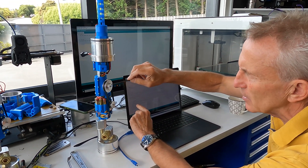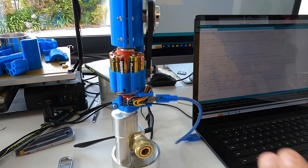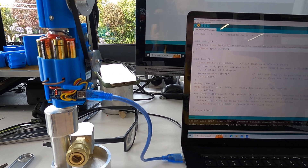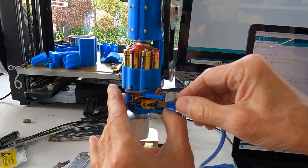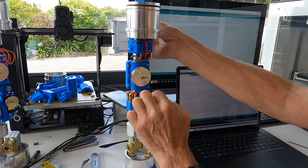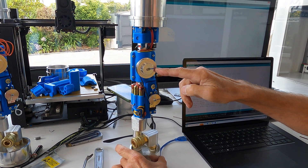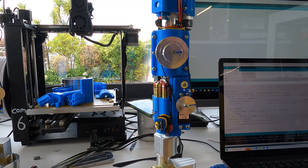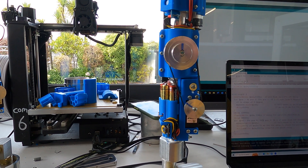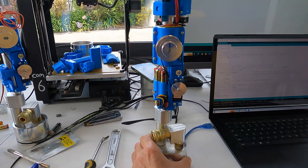What I'm looking for is a 90-degree movement of this — I want that blue line to be vertical, that's the ball valve fully open. We're actually reprogramming one of the nanos right now. Okay, we're uploading that now — that's done, so it's got the new value setting. What we're watching is where this ball valve ends up — that's the main alteration. It's starting there, this movement is the low-pressure oxygen creeping into the chamber — that's pretty good, we'll leave it at that. Wow, that is good.